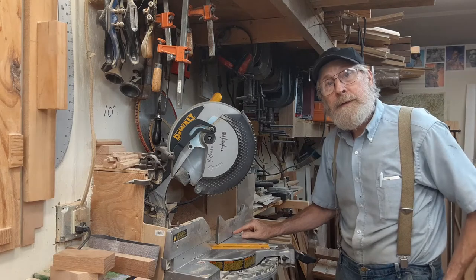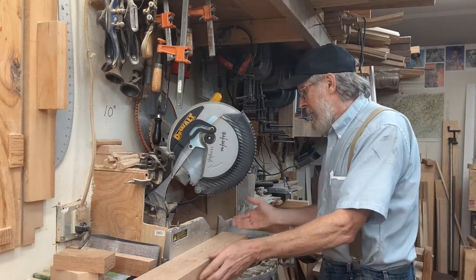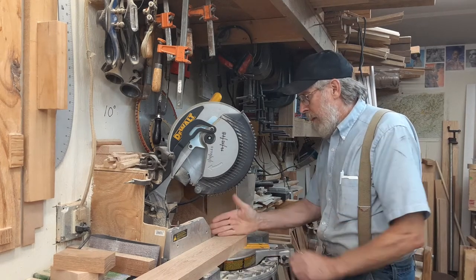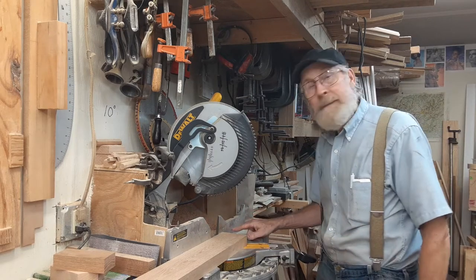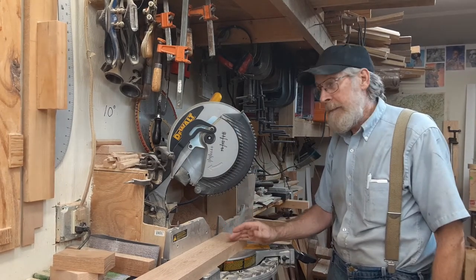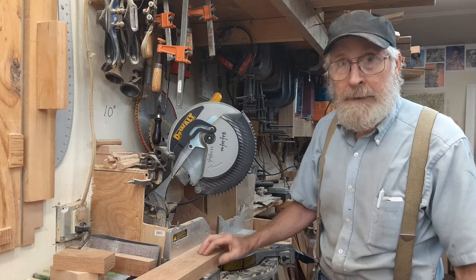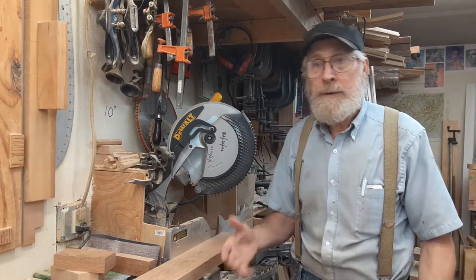I have a mark that's at six inches. The first cut I'm going to make — I'm starting with a square piece so I just have to cut it off. The long point is going to be right here. Once I cut it off, I'm going to flip it over, put my long point at my mark and make the next cut. Then I'll flip it over again and make another cut. I'll show you cutting two, because most of you who want to make one of these shaving horses are just going to need one of these pieces.